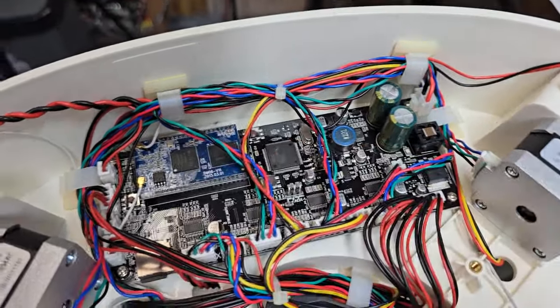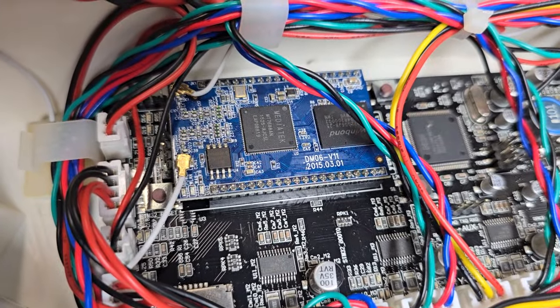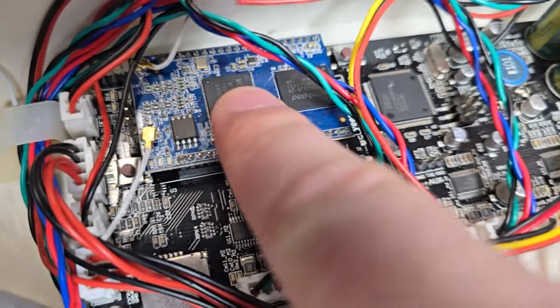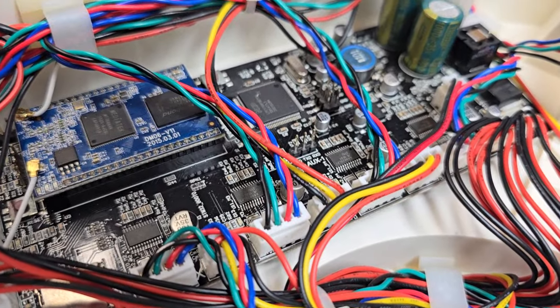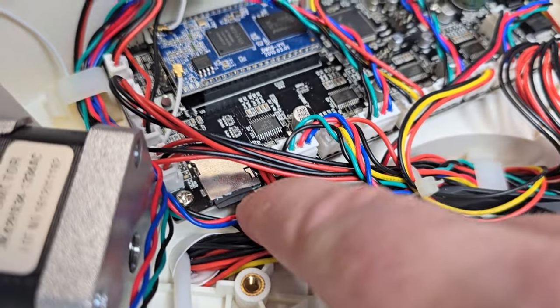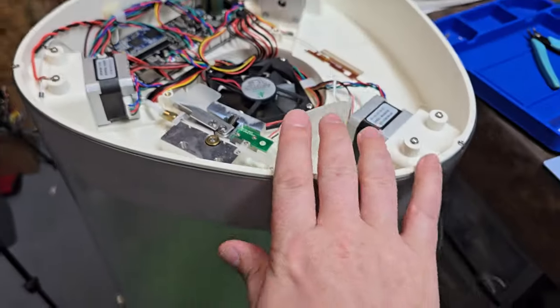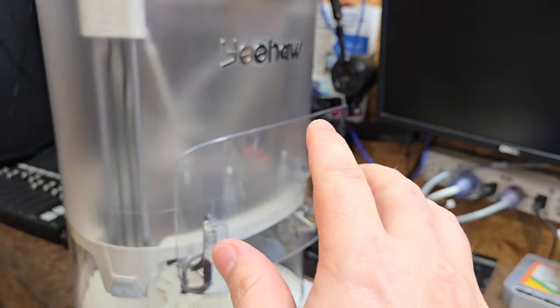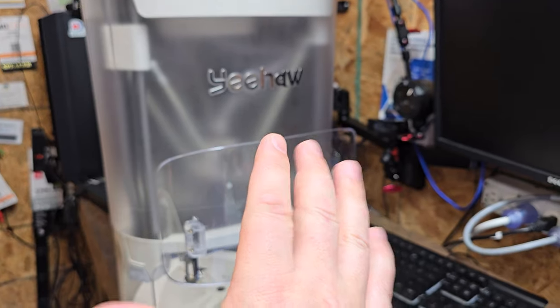This is a custom system-on-a-chip — the MediaTek MT7688. This system-on-a-chip runs the OpenWRT OS and handles all the settings. Earlier I mentioned I had the app downloaded — the original OEM app. However, the OEM app requires logging into some mythical server which does not exist anymore. So if I'm trying to log into a server that doesn't exist, does that make these devices garbage, not usable? No, not at all — because we're going to go into it a little bit deeper.